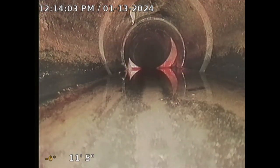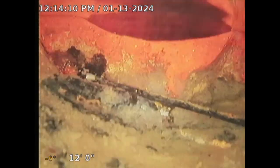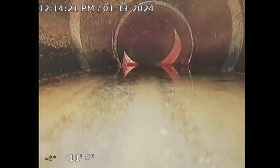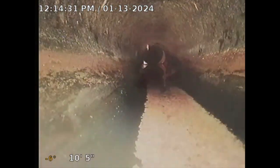I located that joint offset. The good news is it's only three feet deep and it shouldn't be too big a deal to repair. I do recommend repairing it because it's creating a dam effect — you're going to get blockage there. It's located right near the main sewer line at the rear. I took a picture; it'll be in the report. It's only three feet deep, so I recommend having that repaired. Other than that, it looks pretty decent.